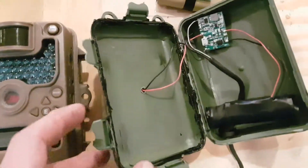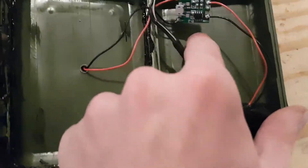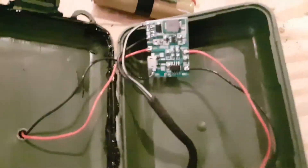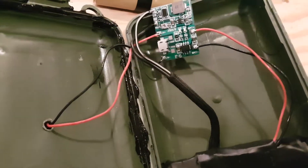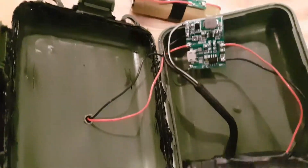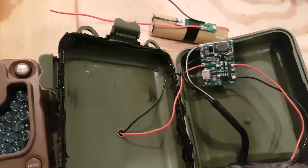What I have here is a little box with a six-volt, one-watt solar panel going to a charging board for lithium cells. It takes the six volts and drops it down to 3.7 or 4.2 volts — it has lithium charging management on the board itself, handling constant current or constant voltage as needed. The board also has a boost or step-up circuit, taking the battery voltage at 3.7 nominal or 4.2 and stepping it up to 12 volts or 6 volts.